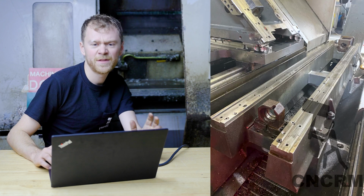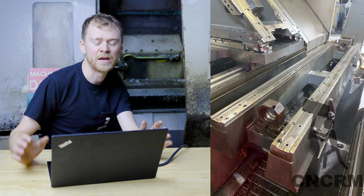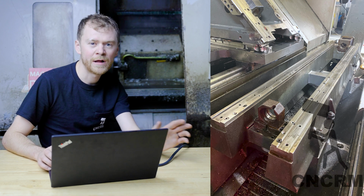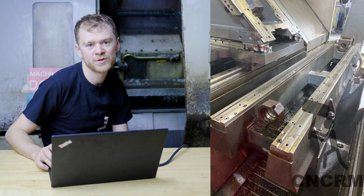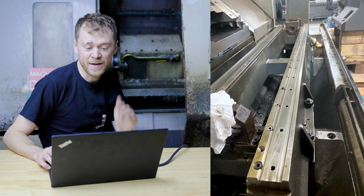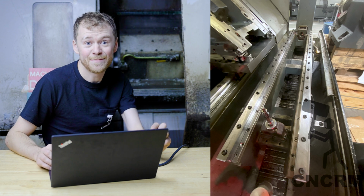So there you can see everything is dirty. And so it's a big process of just cleaning and getting everything ready to put the new parts in. So the rails are out, pull out the cam bolts, blow everything out, pull out the bearings, Scotch-Brite the housings where the bearings sit, get everything ready and clean. Now everything is back in, we're ready to put in the new rails. Wasn't a big deal because I didn't have to tape any bolts on them.